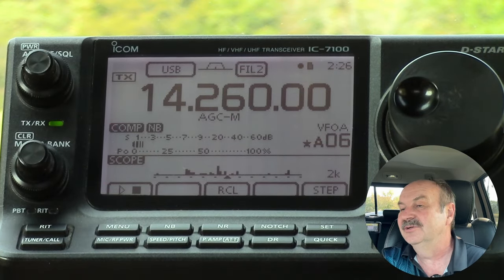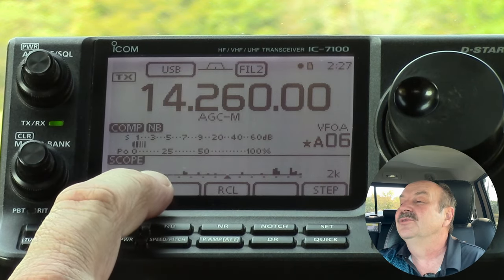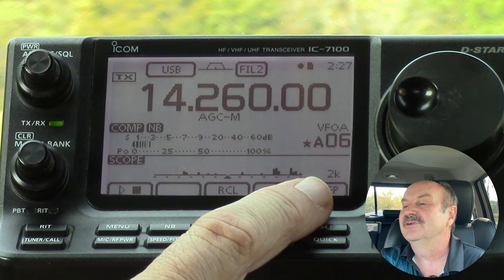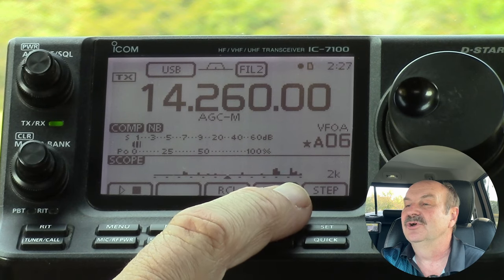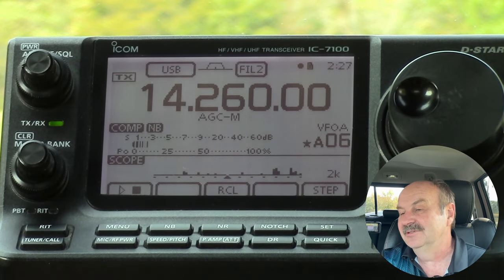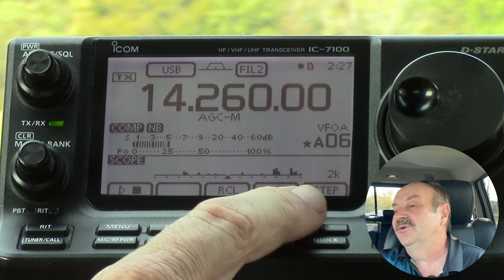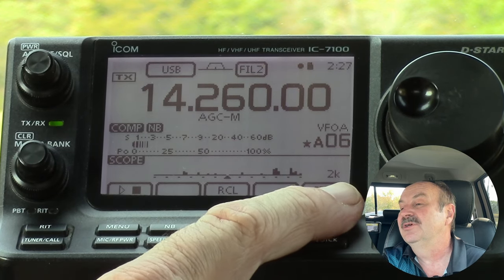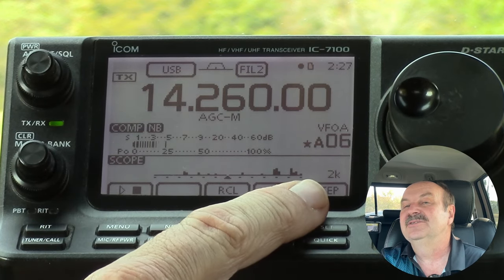Right in the center above the recall button, there is a little tiny arrow below the line that points up. That's the center of the sweep, and it is centered on whatever frequency you're on at the moment. So I'm on 14260 on 20 meters, and when I press this it does a sweep and you see some lines show up. The sweep consists of 60 dots or 60 pixels going across. The vertical line is how strong the signal is, just like on any of the modern scopes. Each pixel going across horizontally represents whatever this step size is - in my case it's 2kHz right now.